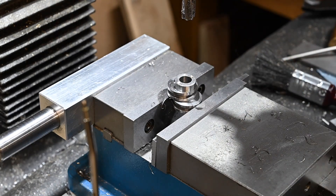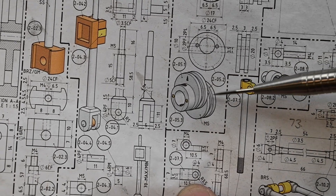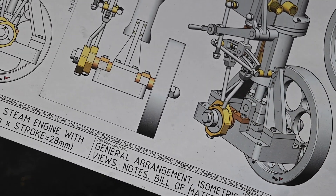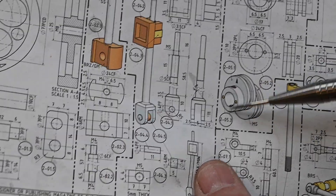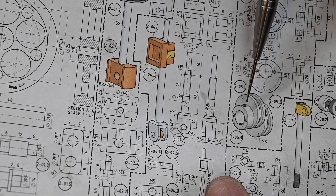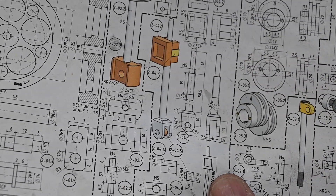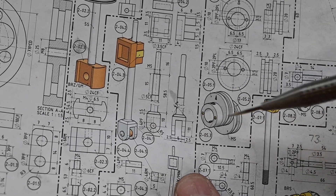Right, 10 millimetre reamed. I'll just get that deburred and cleaned up. That's the finished sheave — that makes up the full eccentric. There's the sheave in there and then the sleeve comes around the outside onto the crank. I've just got to put the holes in for the grub screws, but I'm not going to put them in until I fit it onto the crank. I want to be able to position it on the crank and drill through to put a dimple in the crank before I put the threads in. I'll show that later in the final assembly, but as far as I'm concerned now, that's finished.